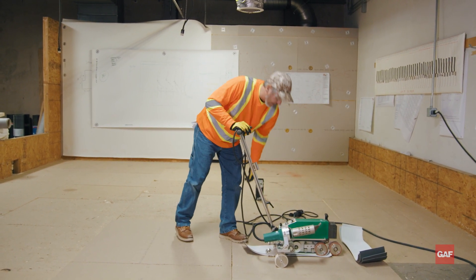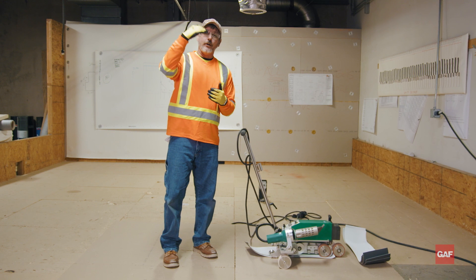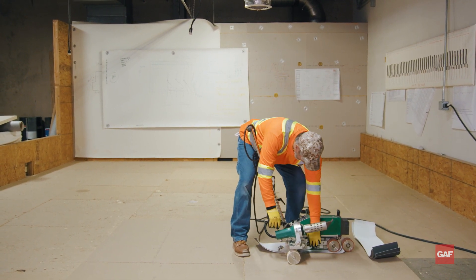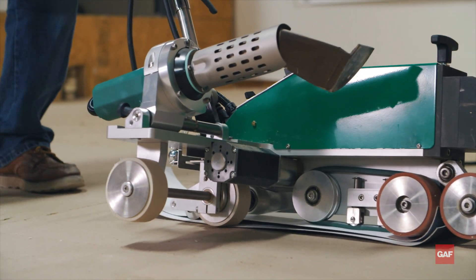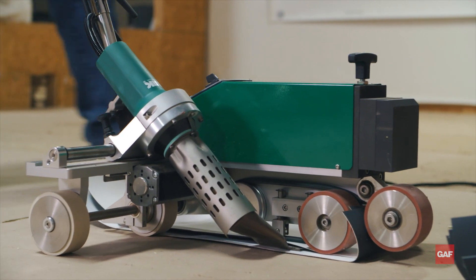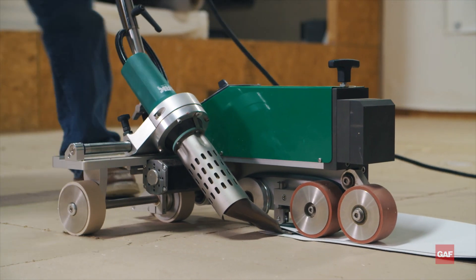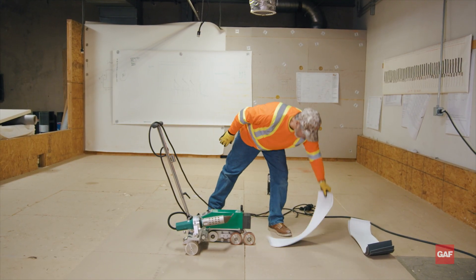We're going to turn this machine on, start at 600 degrees, 10 feet a minute, and go in 100 degree increments until I max this machine out, keeping the same speed. This thing's hot — 600 degrees. It really worries me when people reach down in here to separate that seam; you're getting pretty close to this nozzle. Easiest way: tilt the machine a little bit, take some pressure off that seam, and slide the nozzle right in there. When it engages, it's going to weld right down the seam. I'll let it run all the way out, then reverse the process. We're going to let this cool down and do some test cuts.